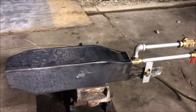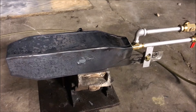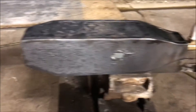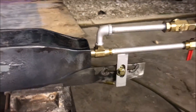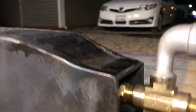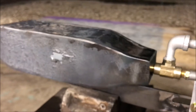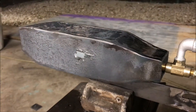There are a lot of things a guy could do to dial this thing in. We could analyze the sound and look at the sound spectrum to determine what setting is the most crisp. My ears can dial it in real close, but I would imagine that a sound analysis — like viewing a video monitor — would definitely help me position this far better. I'm only a half inch moved in there, maybe not even that much, and it had a dramatic impact on combustion. Maybe I should reduce it to a quarter inch.